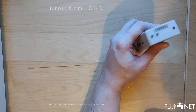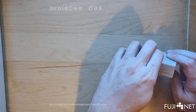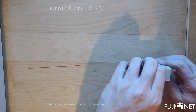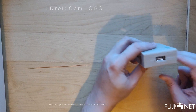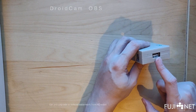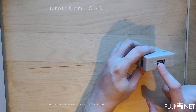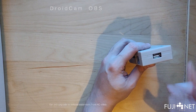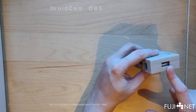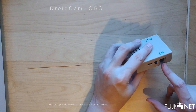On the right-hand side we have the output connector for the ADAM, and we also have a micro SD card slot in which can be put a fairly standard micro SD card. On the bottom we have a USB-A connector — the intent is to allow a USB keyboard to be connected, and I will be adding support in the firmware for that. These are connected directly to GPIO pins, so if you can figure out a protocol to use on them, the connector is there for your use.